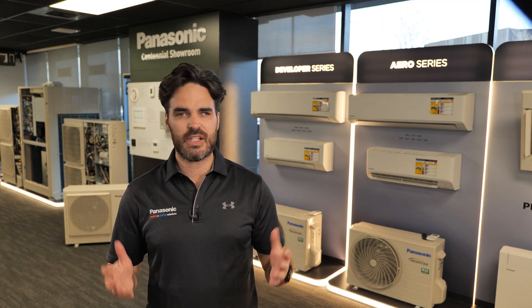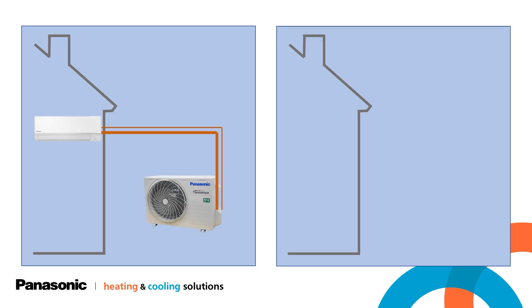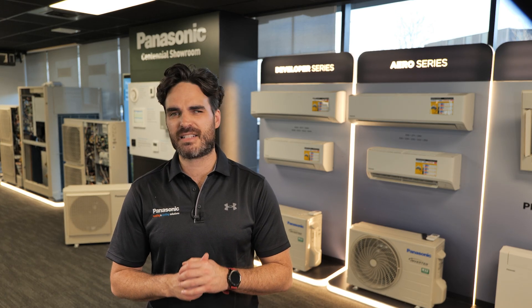First, let's take a look at how a heat pump works. Traditionally, your heat pump system will often comprise of an indoor unit, an outdoor unit and refrigerant piping. Heat is gathered by your outdoor unit through a heat exchanger and transferred to the indoor unit where it is delivered into your house. The hot water system works in basically the same way with a few minor differences.